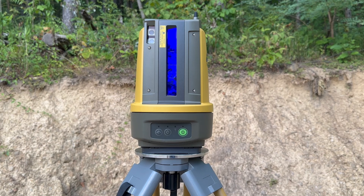This is the LN150. You only need one person to operate this instrument because the operator is located at the prism pole. The distance range is from 0.9 meters to 130 meters, which is about 3 feet to 426 feet. Picture an 850-foot diameter circle centered on the instrument — that is your available working area.